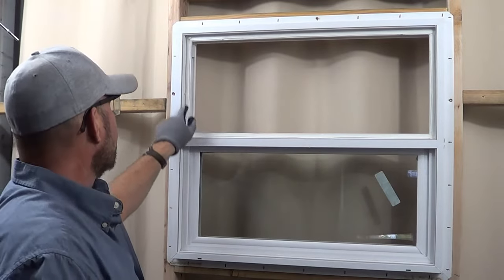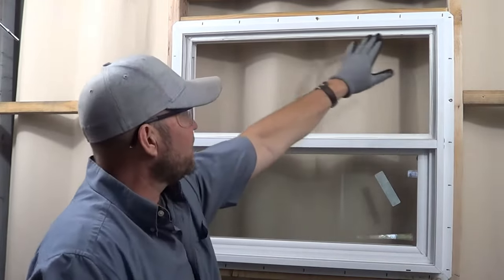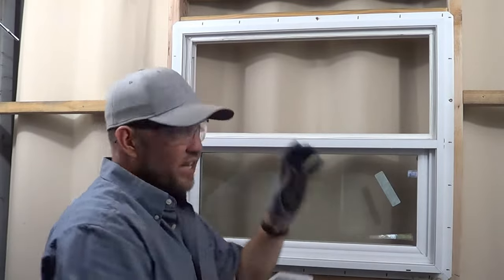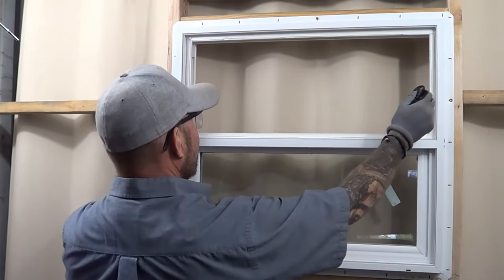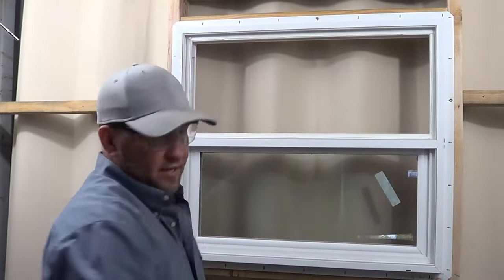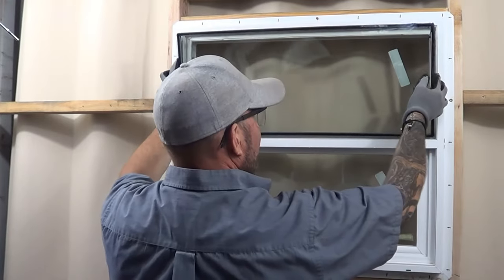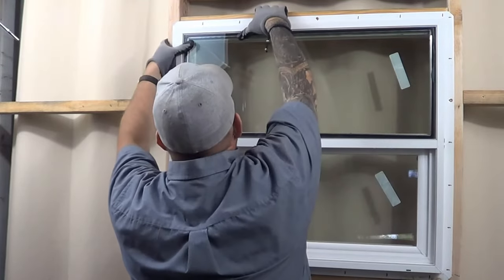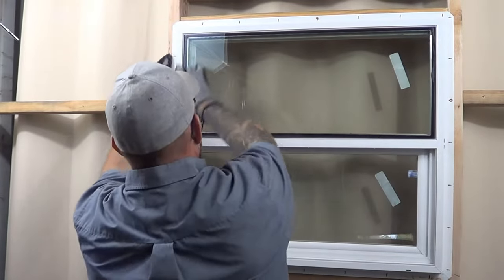So here we are again outside. We've gotten the new double-sided sealant tape on there, and we've got our gloves back on — we want to make sure those edges don't grab us. We need to get this pane directly in the center. What we want to do is wet that a tiny bit, a little bit of spray on that. It'll give you a chance to kind of recenter it a tiny bit on the bottom. We're going to push on the bottom, center it in, lift it a tiny bit off the bottom edge, and then push it into the top so we're centered really well. That water will help you do that, and then it'll dry up and seal just fine. We're really centered on there — give a little push all the way around, and that's really all there is to that. Then we'll put that glazing back on and we'll be done.